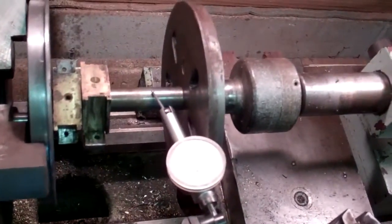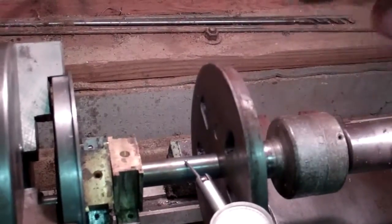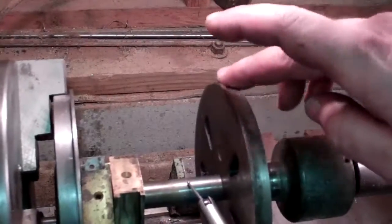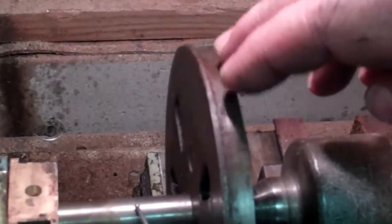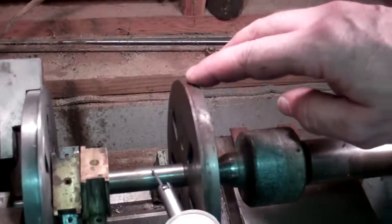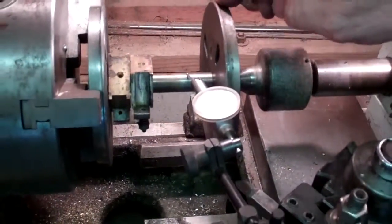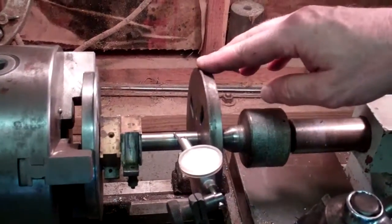What I want to do is take my tool and machine the face of the wheel, the flange on this wheel. This wheel has some rust on it — it's not running badly, it's pretty good as far as trueness goes, but I've got to get rid of this rust. Rust is extremely hard to machine. I've got a carbide tool in my tool holder, because if you try to machine rust with a general purpose high-speed steel tool it'll dull it and put a groove in it almost immediately.